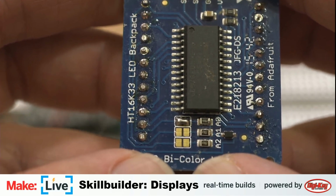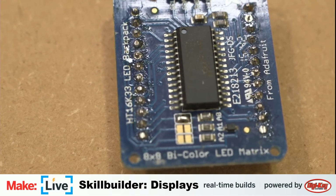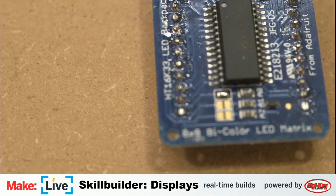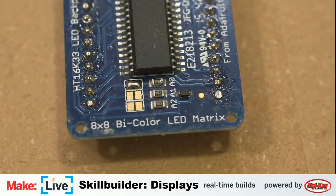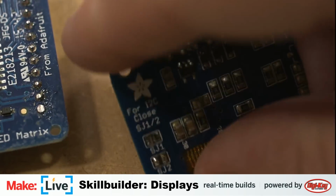Maybe I am getting my soldering iron out. Let's try and pull up that solder pad there. Well, not the solder pad, but the solder bridge. The patch. And so if you look, you can see there's several sets of disconnected pads. And what you would want to do if you want to use those features is bridge them with a little solder patch. Yeah, similar to that.